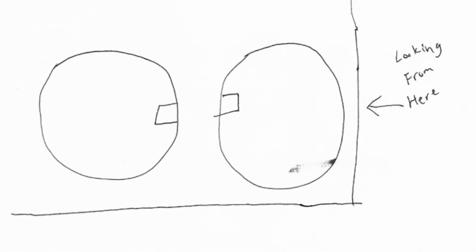It's all about getting it lined up, getting it pushed all the way in, and getting that tab to line up — but you can't see it. In my case there was only one duct on the front side where I could see, and four coming in from the sides. The tabs you have to watch for are pointing inward to the middle, so you can't see any of it — you have to do it all by feel. Good luck if you have to do this. And hey Keystone, thanks for not putting an access panel outside. Don't forget to hit that subscribe button.